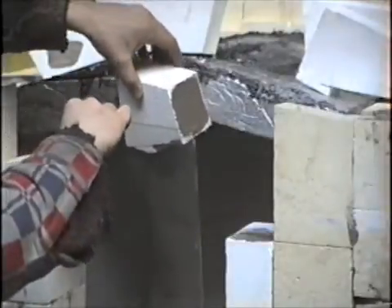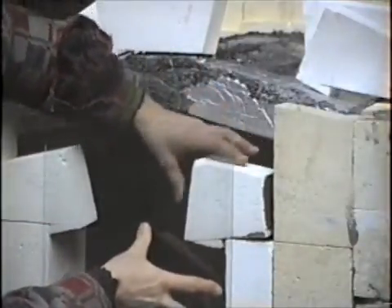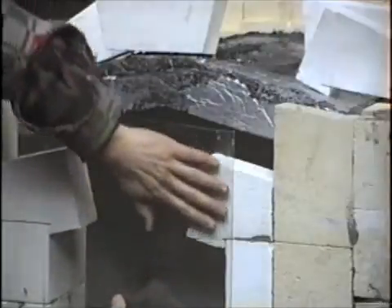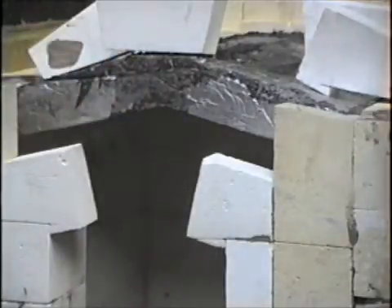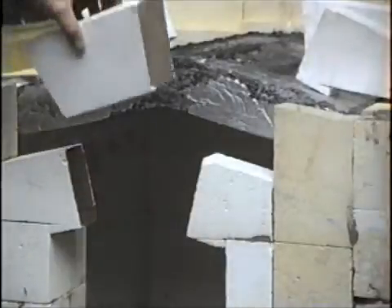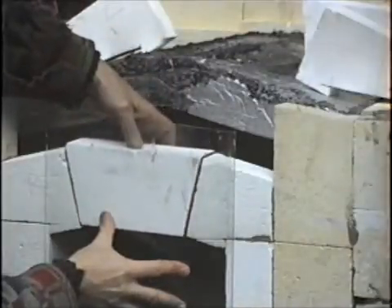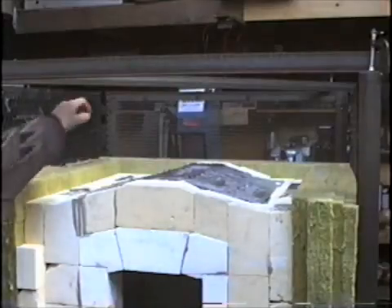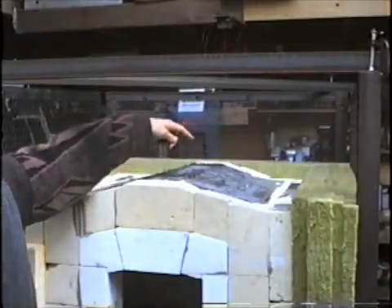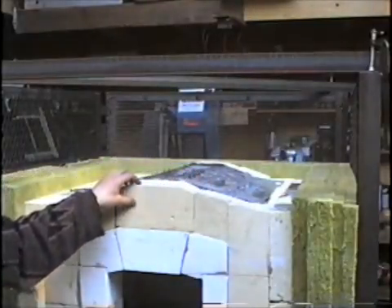I've actually got a sheet of glass here and I'm going to put it against the front to ensure that when I place these in position, I have a nice flush surface that will be the seal when the door closes. And finally, the arch piece. I've cut the K-23 bricks to fit, and I've also placed and mortared in the K-23 bricks across this top course of arch above the entrance.